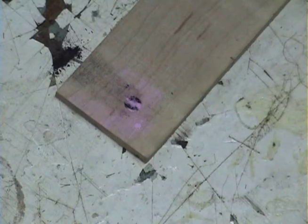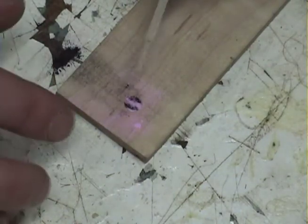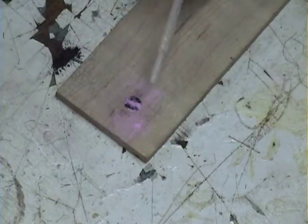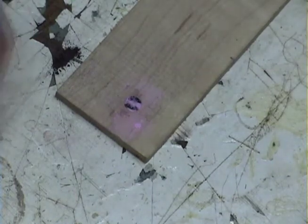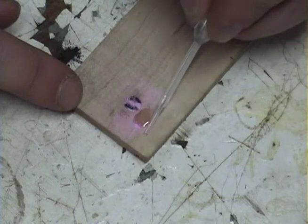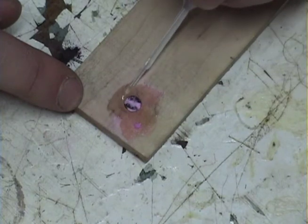We are ready to solidify these dots. One thing I found to be very important: you can't just throw superglue onto the dot. What happens is the dot material — this glow-in-the-dark material — soaks up the superglue and actually becomes smaller; it will actually shrink. If you just drop it on there, it will make imprints and you'll get pockets and hollow spots. When you sand and hit one of those hollow spots, it will just look like a black circle or spot — it won't be attractive. So what I do is go to the edge of the wood near it and just apply superglue there, and it just kind of flows into the pocket where the dot is.